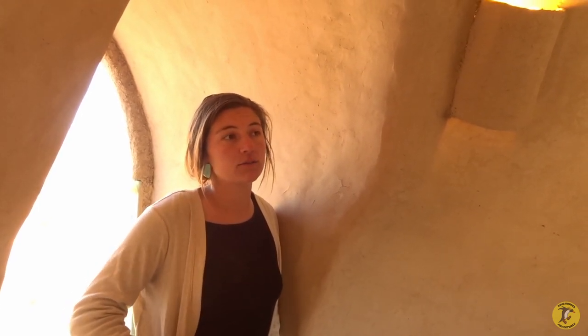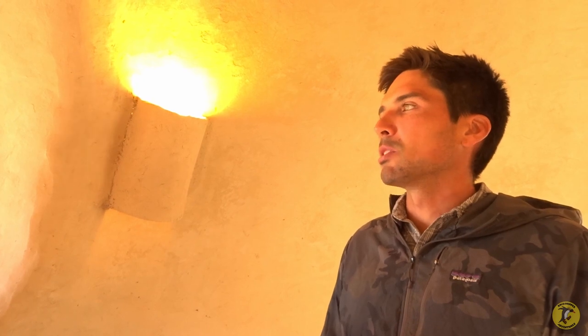The bags are cheap, but whatever native soil you're working with, you may need to add stabilization. Out here in the Mojave desert, the native soil doesn't have any clay in it, so it doesn't bind together well to make a nice block. We have to put lime or cement into the bags at a small percentage — about 10% per mix — to give that extra binding ability. Otherwise it'll turn back into a poofy, silty, sandy soil. That came out to about 25 bags of 90-pound cement here.